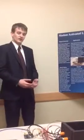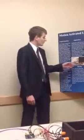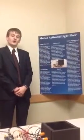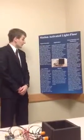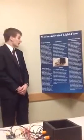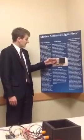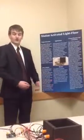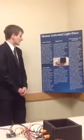For my project, I was able to show proof of concept, though the actual project itself could have used a little bit more on the quality of parts. The issue that I was running into was that I had to use more infrared sensors because they didn't measure the distance. They only told me whether or not there was something in front of it. This was only a small problem, but if I had been able to read distance, I would only have to use 3 infrared sensors.